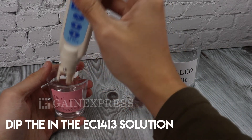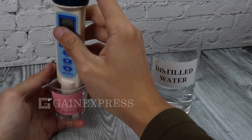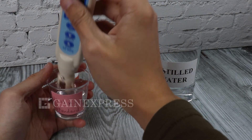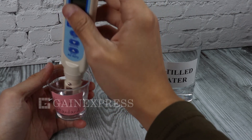Please make sure there are no air bubbles attached on the electrode. Swing the probe and the air can get rid of the bubble easily. Just repeat this procedure for about 5 times. Let the probe stabilize to the solution temperature.